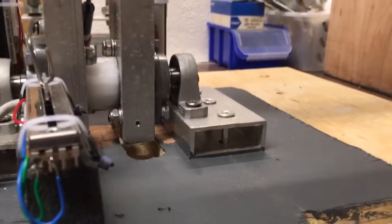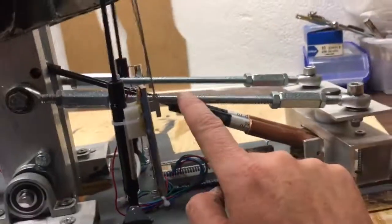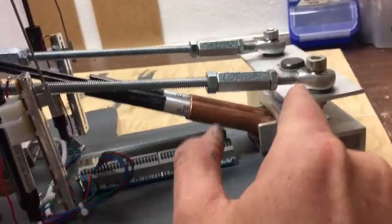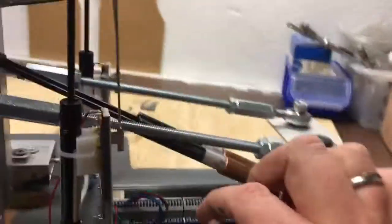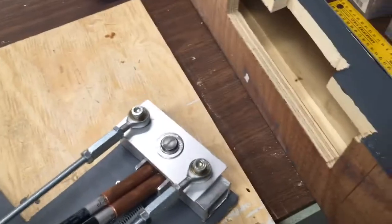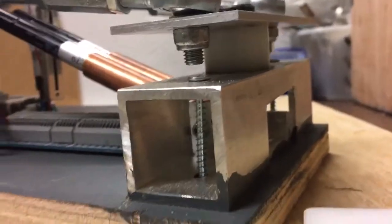To transfer the movement I've used 8mm rods going to these eye bolts on this moving piece of aluminum here, and secured to the shaft with another eye bolt, which makes it really tight. The center piece of the transferring unit is simply a piece of aluminum placed on another piece of aluminum with a nylon piece in between.